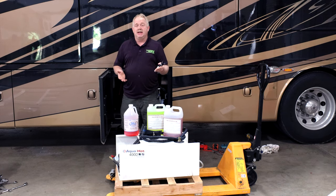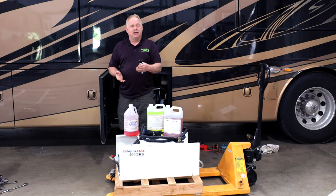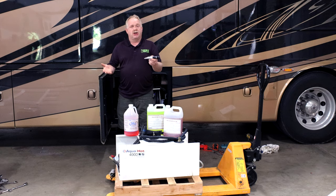Traditionally you may only need to add water only, not actually antifreeze. So it's a good idea to physically have a refractometer to be able to check your glycol content in the actual reservoir or in the tank.